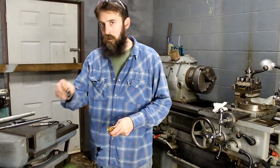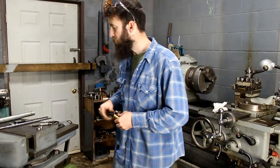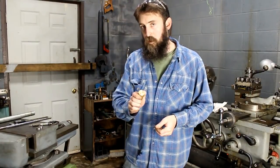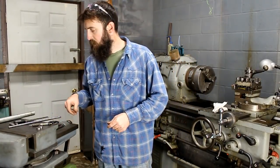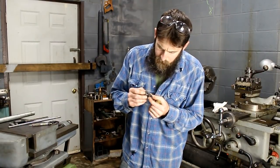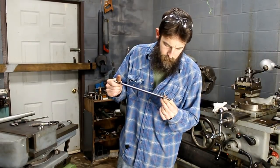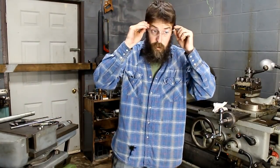We're going to make a couple bushings, just like these, except non-worn. And we're going to make them out of brass, because brass is what we have. I'd like to use sintered bronze or something, but we don't have that, and this is not a production piece of equipment anyway. This is much softer than the actual rod that goes through the center, and I don't know what material these are, but they look like some sort of bearing material, and they're just sacrificial. These are supposed to wear before the shaft, and the shaft has a little wear on it, but it's really minor. So let's get this thing in the lathe and see if we can make some bushings out of it.